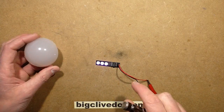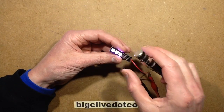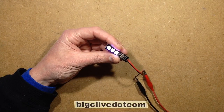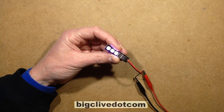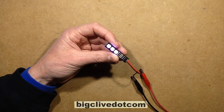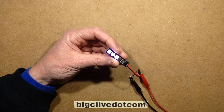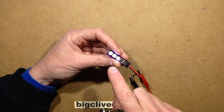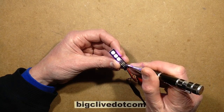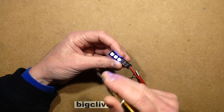It's a useful little device. If you're using this on things like drones at 12 volts, each circuit of LEDs will run at 20 mA per circuit. So if you had this on at full white at full intensity it would draw about 60 mA, which is quite high. At 9 volts it draws about 20 mA for them all, and if you switch them individually on 12 volts it works out about 20 mA just for a single color.